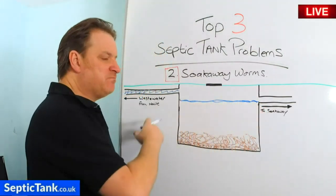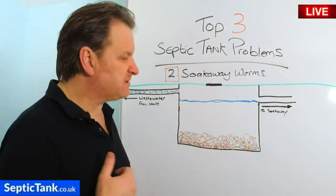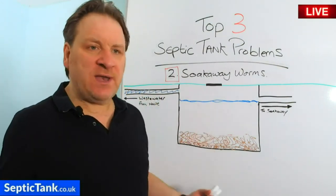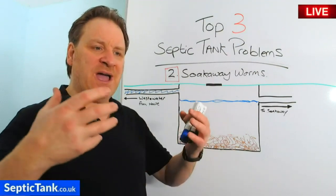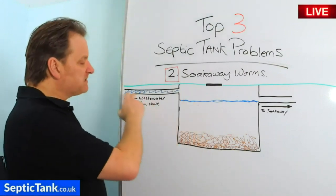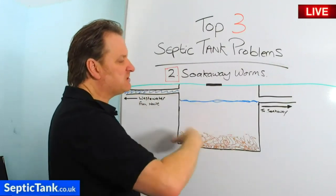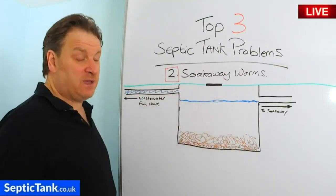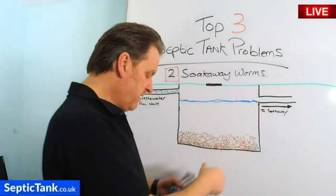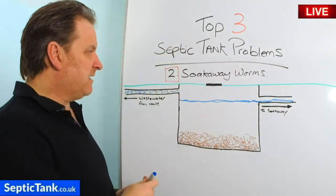Just coming back to that, it's a fallacy about worms drowning. You'll read a lot of misinformation on the internet about worms drowning or that they can't swim. It's a load of rubbish. If you get a stagnant pond that hasn't got any water coming in, hasn't got any water going out, and it's got no oxygen in, all the life in that pond will die, right? With a septic tank, because you've got an in and an out, the fresh water coming in oxygenates the water in the tank, keeps the worms alive, whatever else is alive in there, because it's an aerobic process, right? Keeps everything alive, and that's what keeps the worms alive in the soakaway, in the tank, etc.